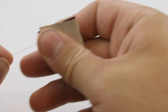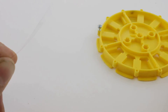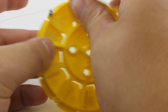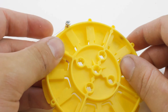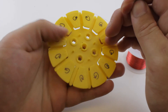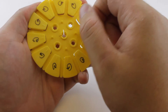Take the insulation off the end of your magnetic wire. Take the part of the wire that you removed the insulation from and wrap it around the screw. Then take your wire and start wrapping it around the first tooth of the stator in the direction that you marked. Since we're using 30 gauge mag wire, you're going to want to wrap it 50 times around each tooth.